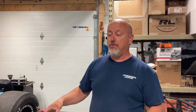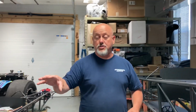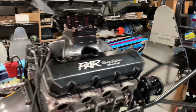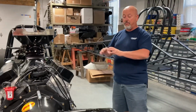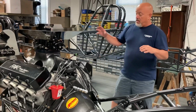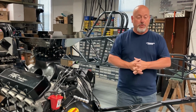This car is complete turnkey, so it's down on lower horses now. Wiring's done, basically. The engine transmission goes in after all the wiring. We'll get the engine transmission in, terminate all the wiring to it. This is ready to be plumbed. I've got all the hoses and fittings here. We'll go ahead and terminate the rest of the wire, plumb everything back here, have this all done. Basically ready for the customer to start. We don't start, we wait for the customer to do that.